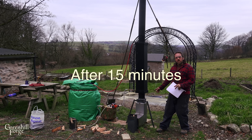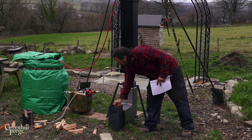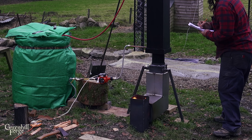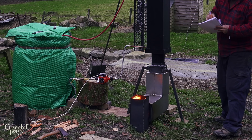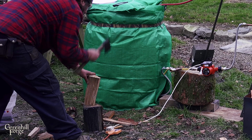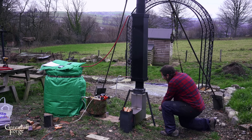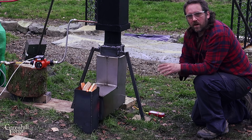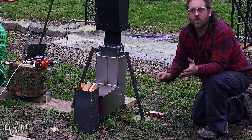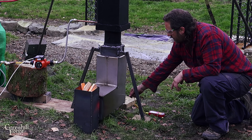At 15 minutes in I've been able to take off the choke so it's flowing at full right now, and I was able to size up quite a bit on the logs. At 30 minutes in we have 1225 degrees at the bottom. I'm trying to dial it in and ride around 1300–1400 degrees. We're getting some pretty screaming red-hot temperatures. Just for fun I'm going to check the temperature in the actual stove — over 1700 degrees already and still going up. Basically I've cracked all the carbons; this thing is burning every last volatile there is, riding right around 1700 degrees.